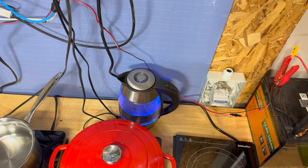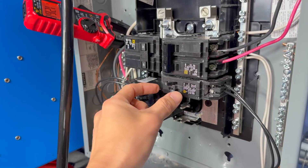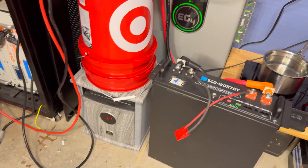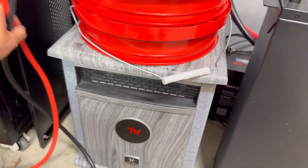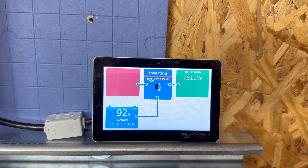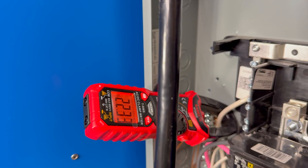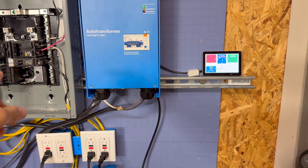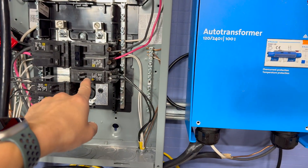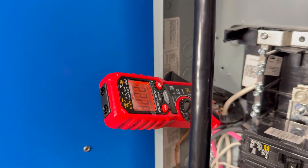The electric tea kettle is going to boil the water quickly so we need to get this testing moving fast. We enable the secondary electric heater inside the garage - only for testing purposes - and reduce the heat setting a little bit for a safety measure. Now we're drawing close to 7,800 watts and 22 amps on the neutral bus, so somewhere around 22-24 amps on one of the legs.